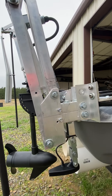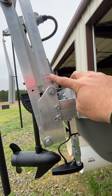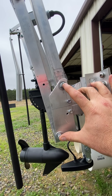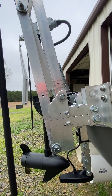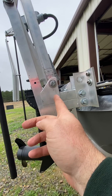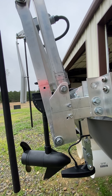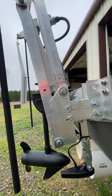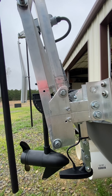A key factor was figuring out how to attach this mechanism so it would actually rotate. The pole closest to the front of the boat is actually shorter in length than the one that goes to the bottom — there's roughly almost six inches of difference. They stack on top of each other but it has to have that particular offset or it will not work — believe me, it took a lot of head scratching. These two pieces also have about a 45-degree cut in this section, and I used some self-tapping screws to hold it together along with the bolts.